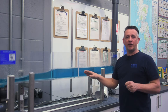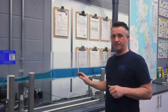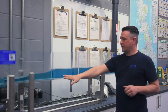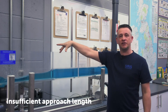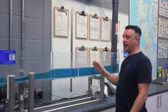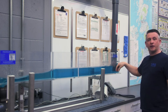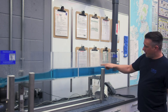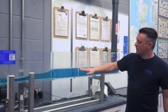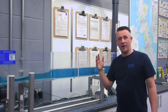Three main problems I've found over the years with flumes are the approach length, the ability for the flume to free discharge, and maintenance or lack of maintenance. In terms of the approach length, British Standard states that it should be 10 times the channel width. So in this example here we do have 10 times the channel width, albeit that the flow is dropping into the front end of the flume. As you can see here, we have fairly turbulent flow conditions, but as you get further down towards the gauging section it goes a lot smoother, which means it's better for gauging the depth and subsequently measuring the flow rate.